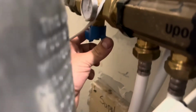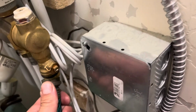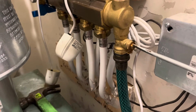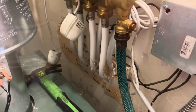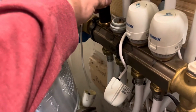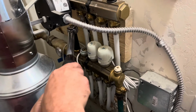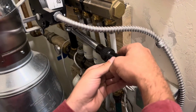So what we do is we close these valves at the manifold. Then we undo the drain valve at the manifold. We let the manifold pressure fall out through this hose. It's now pouring through. It's only about 5 seconds of water. With the manifold pressure off, we can now remove that brass ring that was holding that pin valve in there. It's more secure than that video showed. I just already removed it, process of video making.